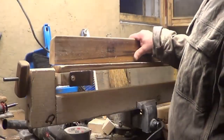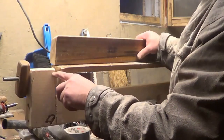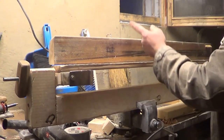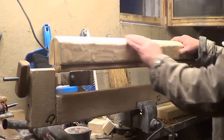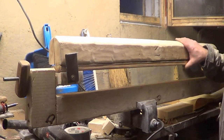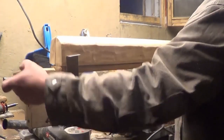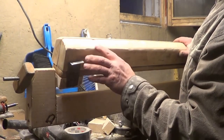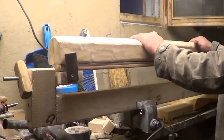Here's where I'm at: I have a little wing nut here to tighten this. I have a rod going right through into that jig I had earlier. What you do is you put your saw with the teeth sticking up in here, put this other piece on, and then turn up these tabs to lock everything into place. You can tilt it back and forth to work on it and use this wing nut to make it nice and tight. The threaded rod that goes through here — the glue is still wet — but once everything is dry and you tighten this nut, it's going to be rock solid.